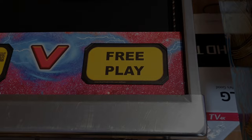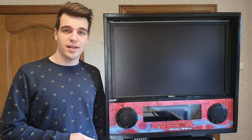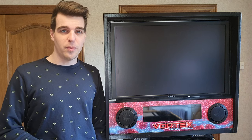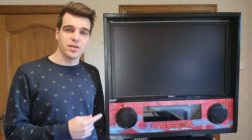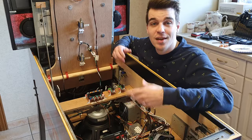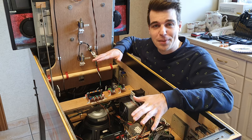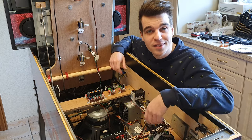However, at this point disaster struck. I have some bad news — things are breaking in the cabinet and I don't really know what's happening. I think it started with a 48V power supply for the flippers and slingshots. The first thing I noticed was the DMD screen stopped working. Next, the USB hub died, and also a 2.1 channel amplifier that I installed for the subwoofer and the speakers. So to try and find the problem, I'm going to make a wiring diagram of this entire cabinet. I hope I can spot a problem and fix it, so let's map out this entire cabinet.